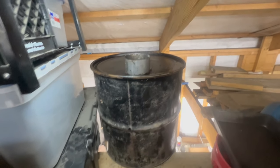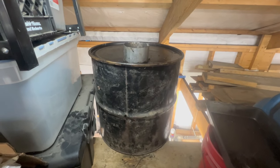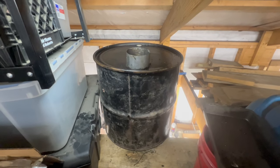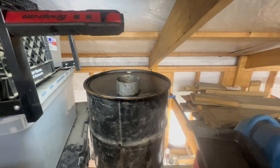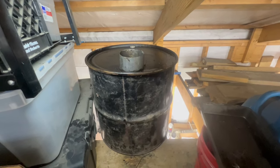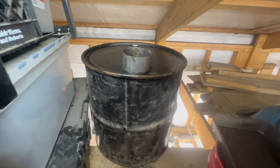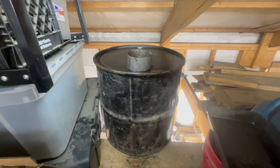We're up here on the loft — this is the waste oil burner reservoir. It's a 55-gallon drum that I cut one ring off of; holds roughly 30 gallons give or take. Just put a wire screen in there to catch big debris that may dump out of the bucket. We've got our 26 gallons of oil up here poured into smaller containers — it makes it easier to pour. My ceiling is here and I didn't want to run it any further from the stove than I had to, because I needed enough fall for it to feed correctly.